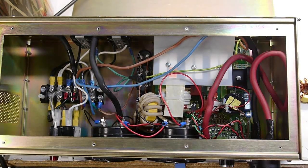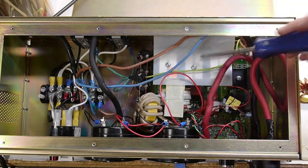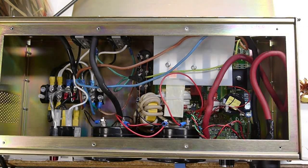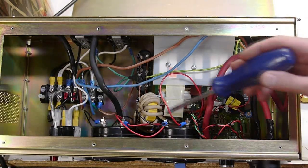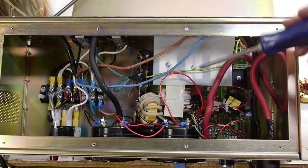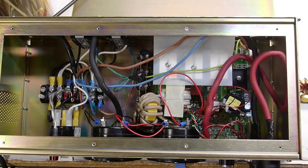It's a little cramped in there but you can see the basic idea. Under this duct, which moves air through some heat sinks, there's a bunch of FETs or switching transistors. It pulses power through a large transformer, and from the transformer it goes through an inductor to smooth out the pulses. I also added that large bank of capacitors there.